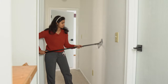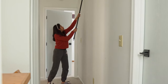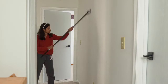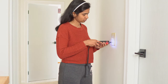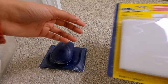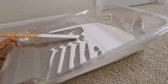Next, paint the wall. Before you start, clean the wall surface — I just used a floor mop for this. Then turn off the power and remove the electrical cover plates. Prep the painting areas by taping off the edges, but I like to use this edge painting tool — it's precise and will save you time from applying painter's tape. By the way, the color I'm using for the wall is Whisper White.